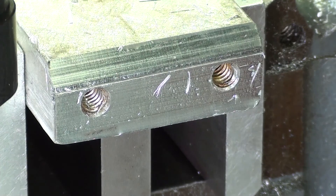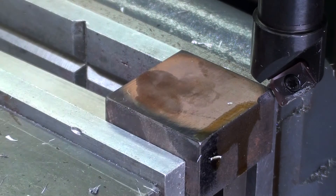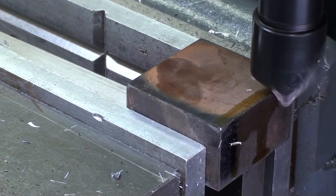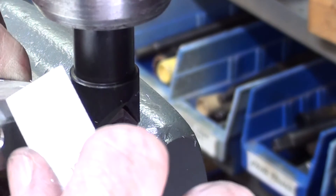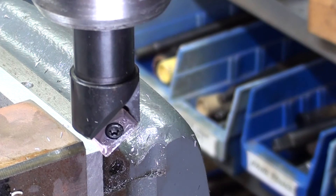I do not know what this insert is designed for — whether it's steel or aluminum. So quickly, I'll take a couple passes on steel. I'm going to slow back down to 1750 RPM. This is free machining lead steel, so let's see what it does — 1725 RPM. On the aluminum block my chamfer is a little over a quarter inch; I'm going to make less of a chamfer here, which is typically what you would do. This will be the final pass — a rather light cut.